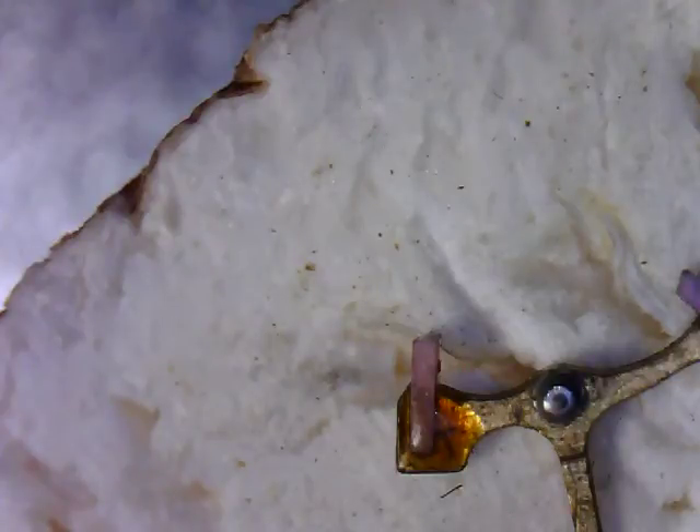There's also discussion about the oil being used — Mobius 9415 — which is synthetic and is supposed to stick nicely anyway. It's designed to kind of solidify when outside of an impact, and then when the jewel hits the surface of the escapement wheel tooth, it stays where it needs to be. It's designed to be reactive, which is quite fascinating. One thing to note: you'll see that dark amber-looking area — that's shellac. That has nothing to do with what we're talking about; it's just a glue holding the jewel in place. I want to make sure people at different levels don't confuse that with fix-a-drop, because fix-a-drop dries clean.